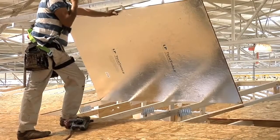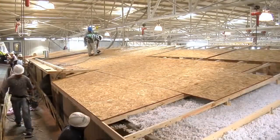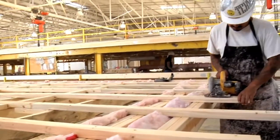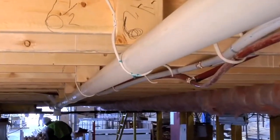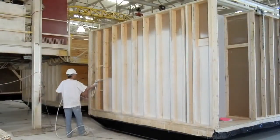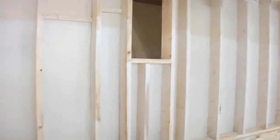The foil-backed radiant barrier roof decking does more to keep the attic space cool than standard OSB roof decking. We go the extra mile on things you can't see that many others may ignore. We label the blocking used to secure the drain lines to ensure the proper slope is maintained. Vapor barrier is applied to the backside of the exterior wall sheetrock as a method of moisture control, sprayed for consistent and complete coverage.